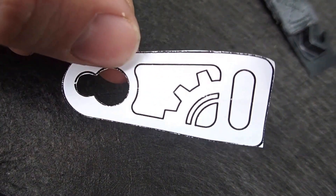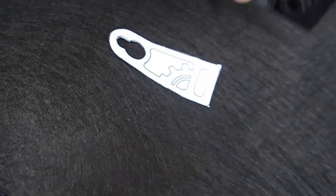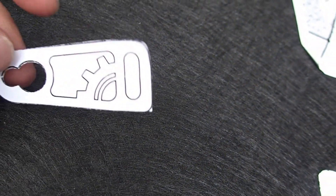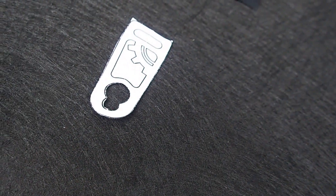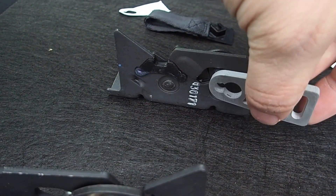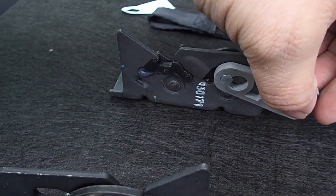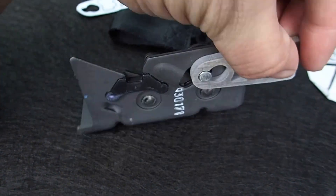My thought was that if we have two overlapping circles, the larger circle could grab that square and allow it to spin, so we don't have the problem with this strap where you have to be pulling in an arc. The smaller circle comes back around so it's not sliding in and out of the pin — this is not just a keyhole. My concern was that I didn't want to compromise the original design. So this is the piece I had water-jet cut — it's pretty slick. It slips on there the same way and won't slip off.